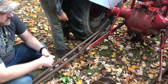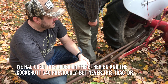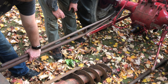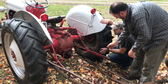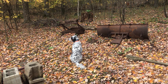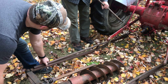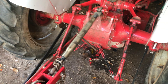So has this never been on this tractor before? It's worked on the other Ford 8N tractor. If that pin were longer, maybe - this side looks like it's further out. But see, it's adjustable - see these bolts on the inside? That tube's split on the bottom, so you can slide that in or out. Stabilizer bar turned out. Real sturdy.